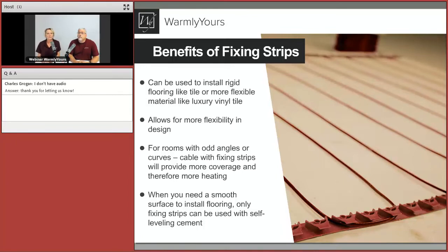If you're heating a floor over a slab, the first thing you want to do is get Ceresorb down over the slab, because you don't want these wires directly resting on concrete — it sucks the heat right in. If you don't put down some type of insulator, you'll basically have a neutral floor. In colder climates you won't be able to get that heat; you're going to need Ceresorb or something like cork to insulate from the slab.